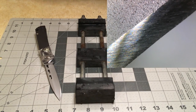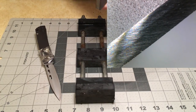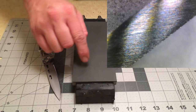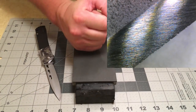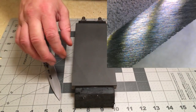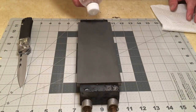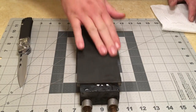Looking at the bevel under the microscope, I can see random scratches that are deeper in some areas. That's possibly what folks are talking about when they say there's pockets of abrasives — little dots or clumps of diamonds. So you've got a polka dot effect; in between those polka dots it's just the binder material, then a pocket of diamond, then binder material, then another pocket of diamond. It's random and scattered with no uniformity. The straight deep scratches in the scratch pattern kind of promote that image — something I noted, and when I show the magnified images you will see it. Maybe I'll put an arrow or something to point them out.